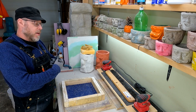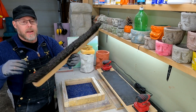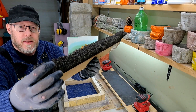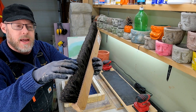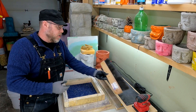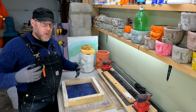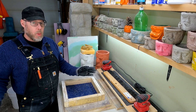Take a look at this to get a feel for the texture — it's kind of a soft bristle, it's dense, there are a lot of them, and it's relatively soft. That's what you're looking for. Don't go for something with a really stiff or coarse broom — that's going to be too much for texturing concrete.